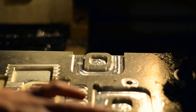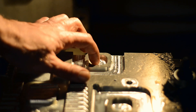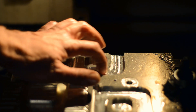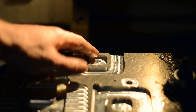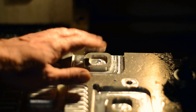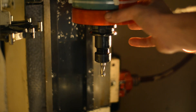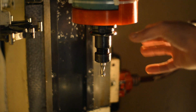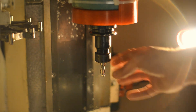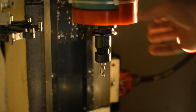The gibs aren't really tight at all yet, so I'll tighten them up a little more and play around with it. Might be tool deflection - I ran the finishing pass at 0.1 millimeters, could try 0.05 to see if that helps. It works - works better than before. I also 3D printed a new nozzle for the coolant. It's the first iteration and it's not perfect - it hits the collets - but it's probably better than the last setup.